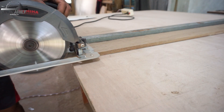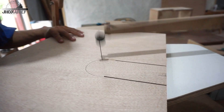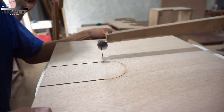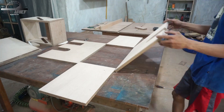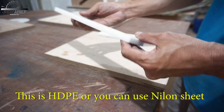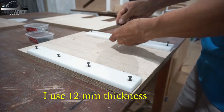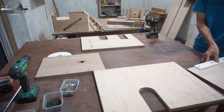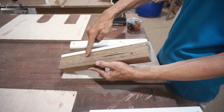Next we're going to make the outer box for the lifting mechanism. This groove is for the blade shaft to travel up and down, so this is the lifting mechanism outer box, and we make this on two sides as well. You can see the other side has two square holes — the additional square hole is for the lifting knife. Now this is the important part: this is HDPE, or you can call it a nylon sheet. I use 12mm thick nylon sheet for the slider, because nylon sheet is slippery and it's good for the slider mechanism. I add the nylon sheet on four sides.